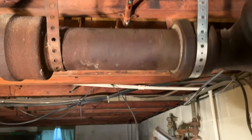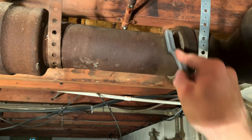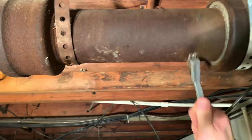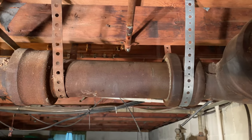Another thing I like to do beforehand is just go ahead and take a wire brush and just clean off the section of cast iron pipe that's going to receive the FernCo later on. You can do this after you cut it as well, but I feel like there's less likelihood that there's going to be sewage on it or other contaminants. So just go all the way around the pipe. We have our one notch right here on this side and then on the other side we have our second notch, and we should be ready to rock and roll and make these cuts.